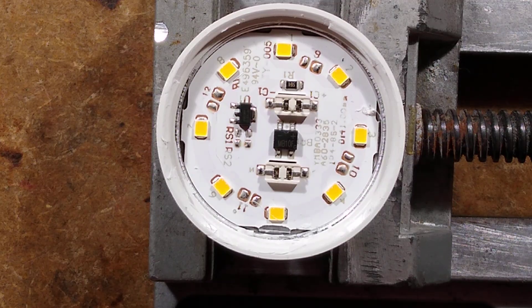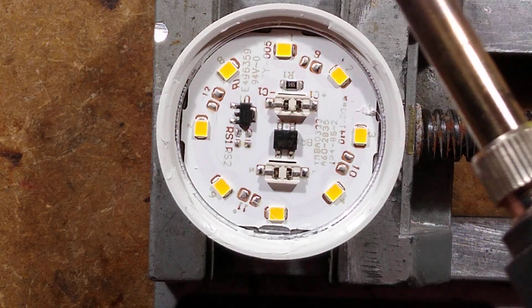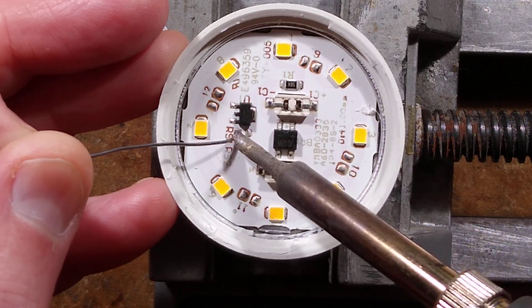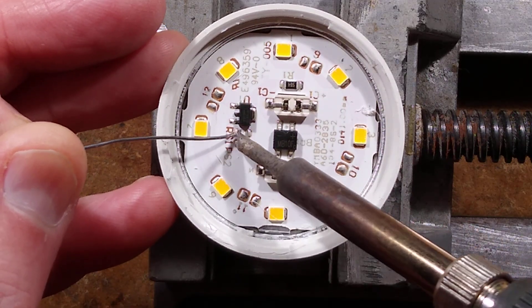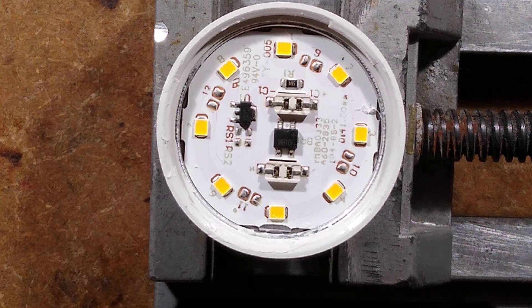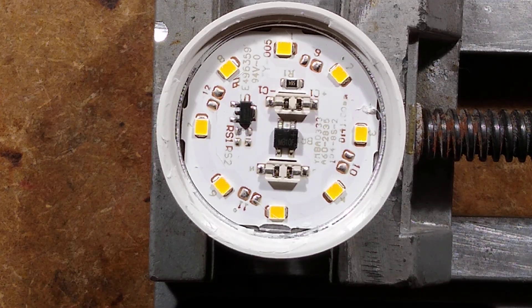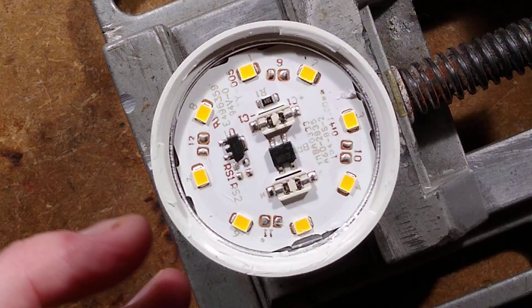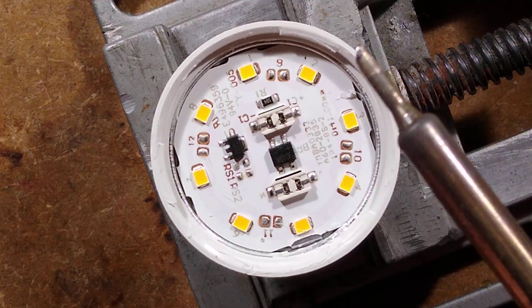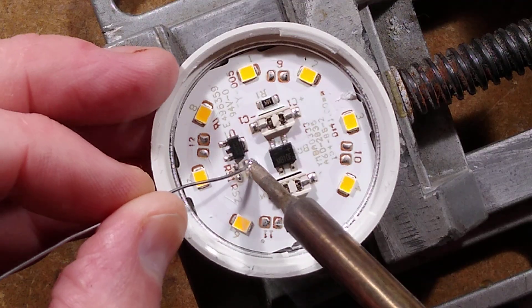Let's bring that into shot and bring the soldering iron in. I shall put it onto these pads and try to move what was left before. By soldering onto the existing solder it's going to make it easier to get a connection. A thermal couple conked out in the soldering iron — it was showing weird temperatures. Different handle on now, and this is a lot better.